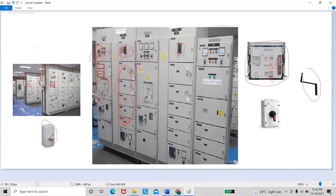we can remove the warning signs. After we remove the warning sign, we can record all the work that we have done in the logbook to avoid missing records. After we record the process, we must close the permit that we already applied. Okay, that's all for me.